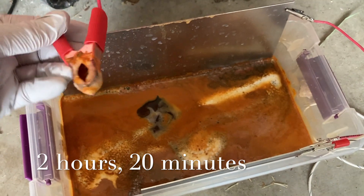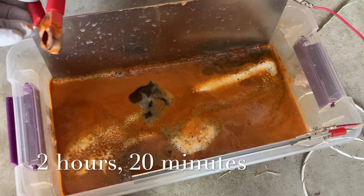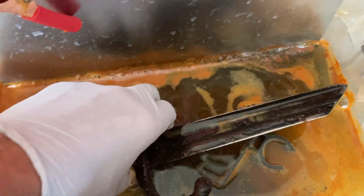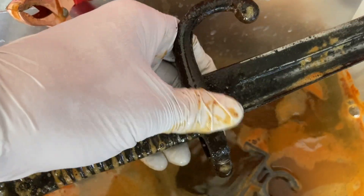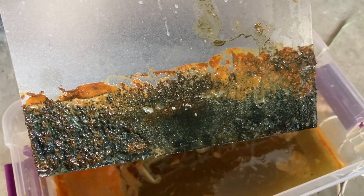That definitely doesn't look corroded or anything, so apparently there's nothing wrong with that. This is the backside of that plate — really nothing. You can see that the reaction here is generally line of sight — it's between the part in question and your sacrificial anode. Look at the back: I haven't wiped that or anything. So after four hours, this is still proceeding very nicely.